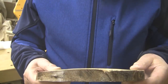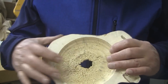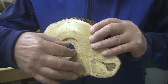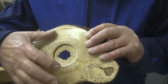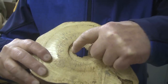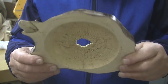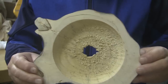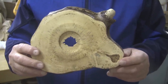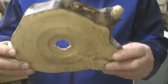I'm not entirely certain what I'm going to do. I'm not going to fix it — I'm going to make it better. How's that? I'm going to remount it and sand all this in here and see what we have, see what it looks like. The problem is that hole — see how close it is to the edge here? This is where my chuck jaws grab. They go inside of this opening and they spread out. That's how it is held on the chuck. But see how close it is to this chuck jaw right here? Really close. So I thought I might make a perfect hole and we can call it a perfect bowl with a perfect hole, but I'm not so sure I can make that hole perfect. Maybe it doesn't need to be perfect if it's going to be a unicorn. Maybe you don't want a perfectly round hole, because that blue-eyed unicorn looks pretty good. I could put a hole in here and just hang it on the wall. I'm going to mess with it.